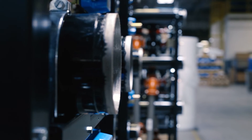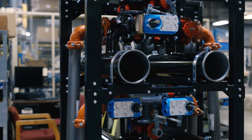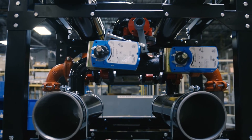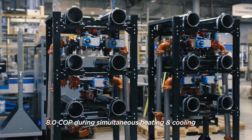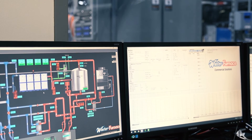In applications with a diverse heating and cooling load, our patented 6-pipe header rack design can provide simultaneous heating and cooling, which is unique in the industry. The modular chiller can exceed 8 COP during simultaneous heating and cooling, allowing this equipment to be an efficient single plant solution for heating and cooling.